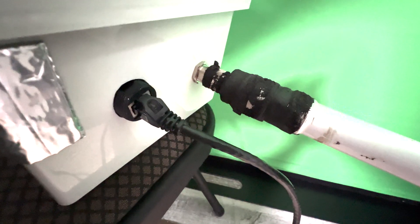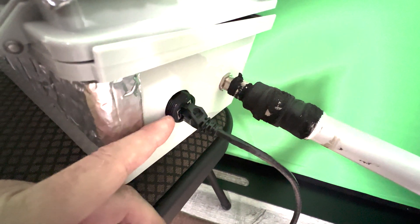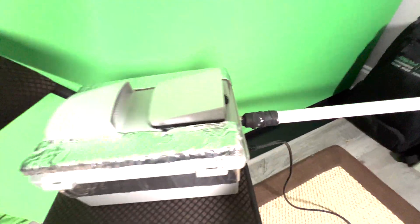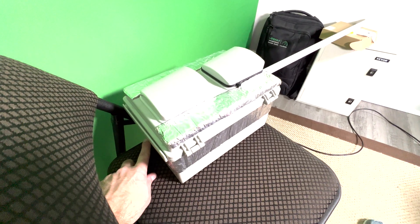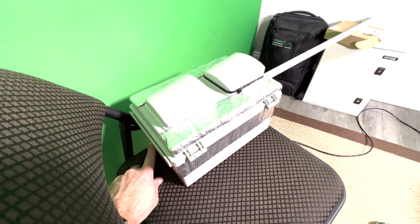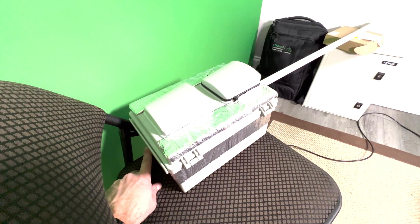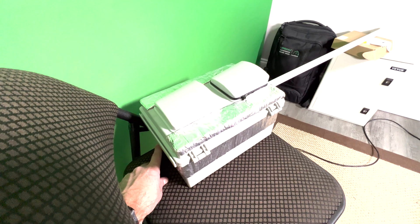As far as the bottom down here, this is where I've got the antenna connection with the N-type bulkhead fitting, and also a coax or ethernet cable pass-through. There is a fitting that will actually allow the ethernet cable to pass through and remain watertight — it screws onto the outside. On some of the earlier builds I actually put the N-type bulkhead up on the top of the box, which makes connecting the antenna easier, but over time any tape you put around the top could fail, and the N-type bulkhead fittings are supposed to be waterproof but will be exposed to rain and the elements.